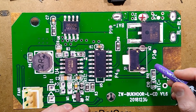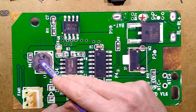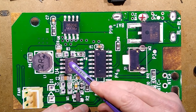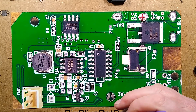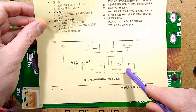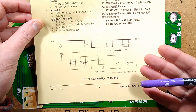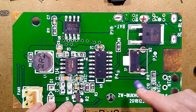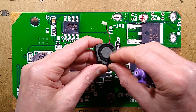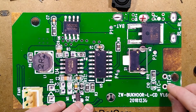Reverse engineering done. Let's take a look at the circuitry — it's a bit more complex than I was expecting. I initially thought that would be the battery control chip, that would be maybe a boost circuit with this inductor for the fan, that would be the microcontroller, and that would be the output transistor — and I was almost correct but not quite. Let's start with this chip here: IP9315. That is a fully-fledged power bank chip complete with the ability to drive LEDs. It's got the little inductor for stepping the voltage up, and a pin dedicated to a flashlight function. It's dealing with battery charging and regulation of the 5-volt supply, and also powering this cute little fan.